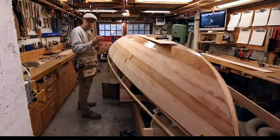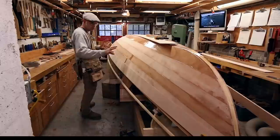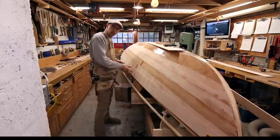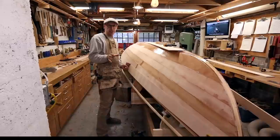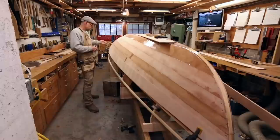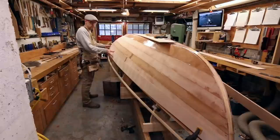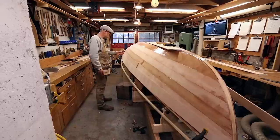That changes the attitude of the plank just a little bit. Now when I'm working with shorter planks, it's not a big deal — I can make up for it, I can fudge it, because I've got a little bit of wiggle room with each section. Especially if I'm doing it in three pieces, I've got quite a bit of wiggle room because I've got two breaks in the plank, and you can tweak that shape and then dial it all in when you fair the scarves. In this plank, I had some pre-scarfed stock, so let's try tracing it out full length and seeing how that affects the finished fit. Here at the back end it's fitting nicely, following our lap line, and it's all laying nice and fair — touching the plank lap properly and touching the batten down below properly. It looks really good up until right about midships, where we start diverging off the line.